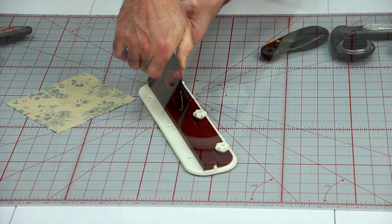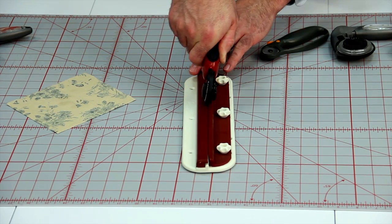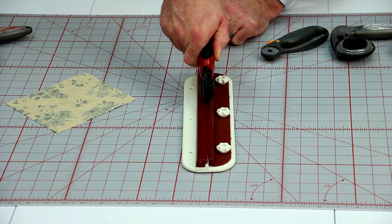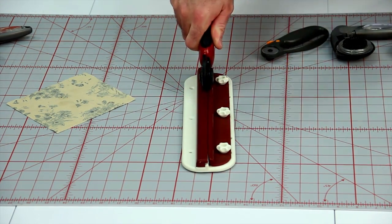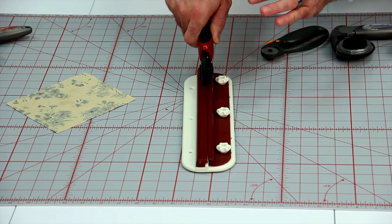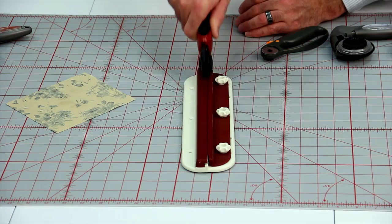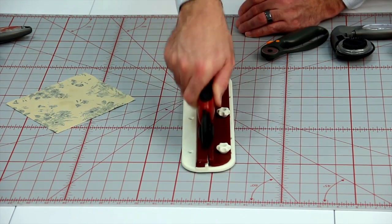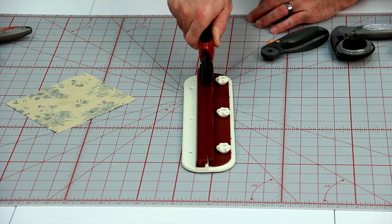It is critical, however, if we look at this, that my cutter is not tilted or tipped into the stone or away from the stone, but it is, in essence, perpendicular to that surface. But we use the same process, and it does not take a lot of down force, all we're doing is just keeping that cutter in by the stone. We're going to use the same process to cut now, but we're going to push this back and forth, and what that will do is sharpen the right side of my blade currently, your left side.